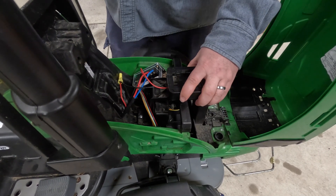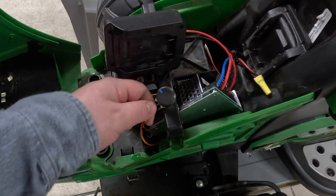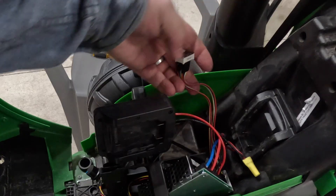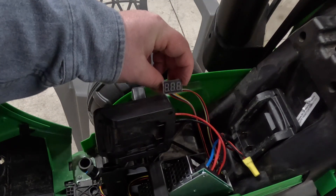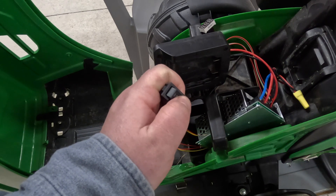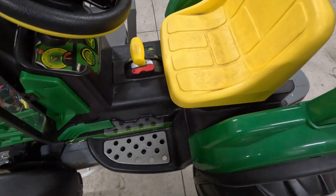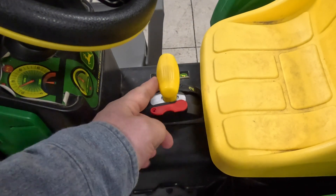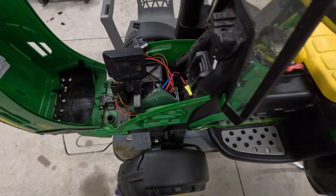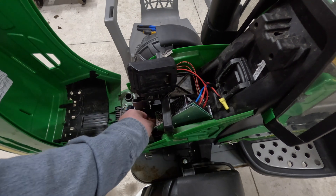We may attach this potentiometer here, which will change the voltage output from the motor controller. Then here's our secondary battery holder, and we'll also have a little LCD screen that will tell us the voltage. Down at the bottom there is a switch that changes the polarity going to the motors. Since this tractor already has a switch that goes reverse, speed one, and speed two, we're basically just going to use the polarity switch to reverse, tuck it away, and not utilize it in this build.